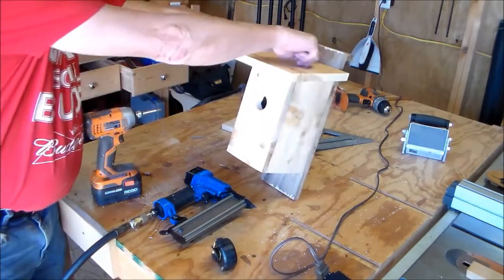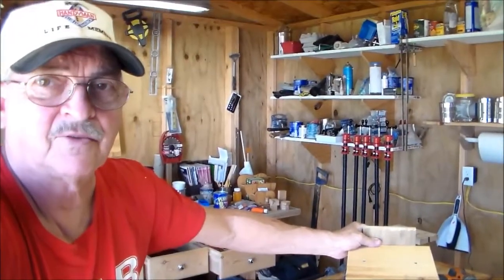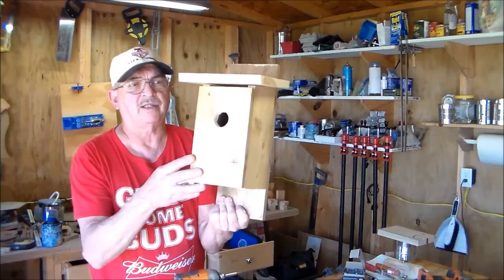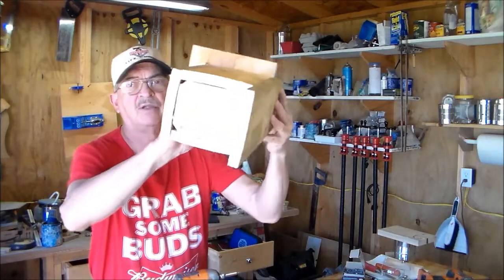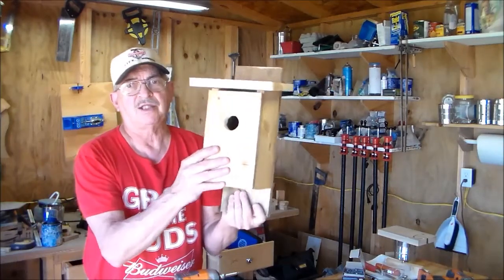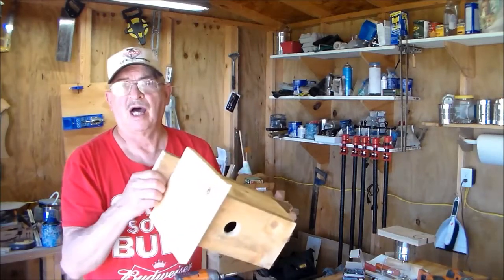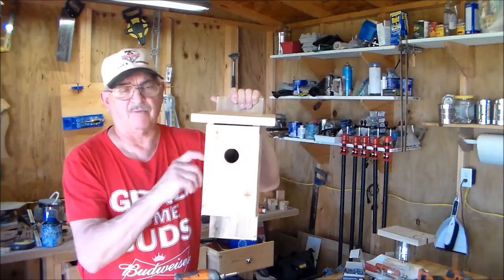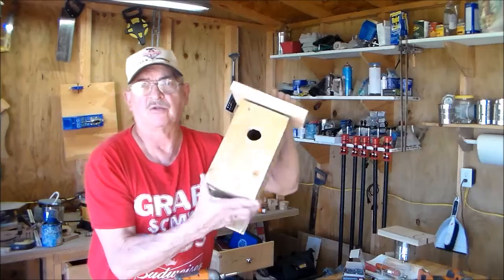There you go — one birdhouse, ready to hang. Drill a hole here and one down there and hang it on a wall, a tree, or whatever. You really don't want to be that fancy with them. It's a real quick and easy project. You notice under here the slot — that's for air out. The bottom drains for any moisture that gets in. The hole fits chickadees and bluebirds. Look on the internet — you can make these any size. Smaller boxes with smaller holes for smaller birds, bigger boxes and bigger holes for bigger birds. This is just made out of scrap pine and it'll last years. I don't paint them — birds don't seem to like paint. If you want to make them pretty, do it in the wintertime and let the outside dry. Never paint the inside of a box. If you want to keep them around a while, use cedar, redwood, or cypress — make them out of that and it'll last a long while.